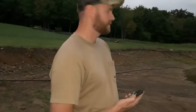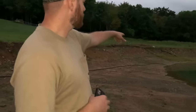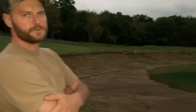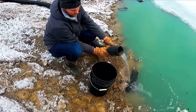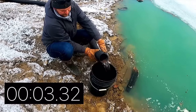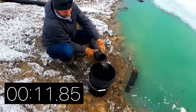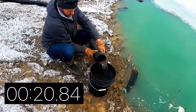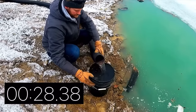Do you remember how many gallons you were getting out of that pipe at its mid-level? Our spring head down there — when we're going through the spring thaw and all of our snow melt and snowpack is melting off — I measured that back in March or April, we were getting about 10 gallons per minute out of that. But when we've had as dry a summer as we have, the ground is just rock hard. A lot of our springs are dry springs. Right now we've got just a trickle coming out of there, so it's really nice to be able to supplement with the stream and the siphon. Let's go over and measure that one real quick.